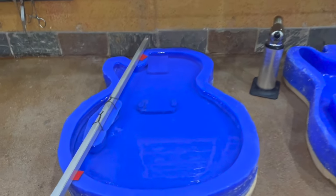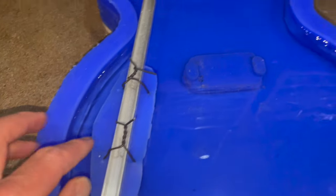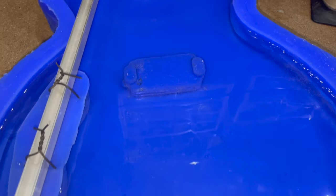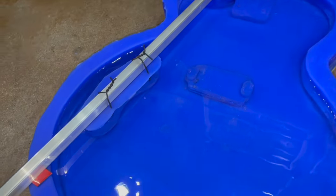It's been a full 36 hours and I can see some interesting ripples around the edges. It feels like it might've domed up a little bit, but it cured nice and solid. This stuff takes a long time to cure compared to other epoxies I've used — I think that's just because it's exothermic, and the long-pour stuff needs to cure very slowly so it doesn't get too hot. We're going to demold it and see what we got.